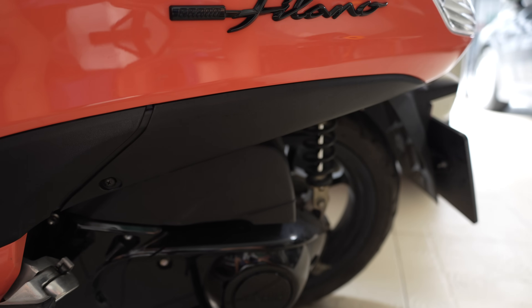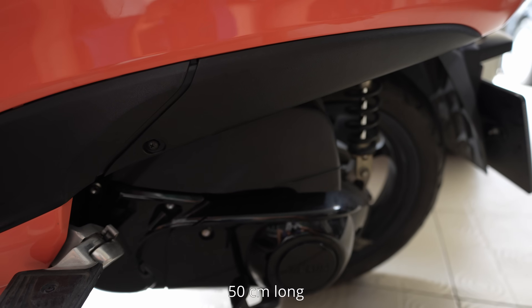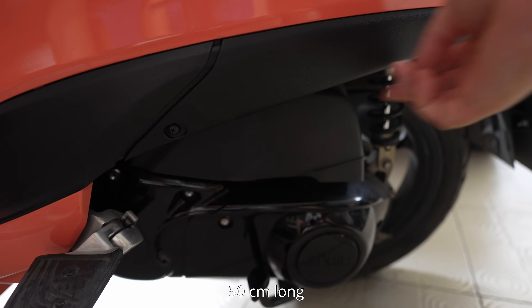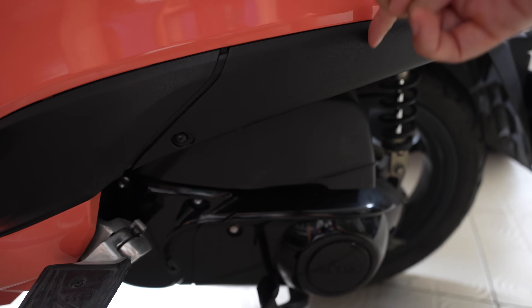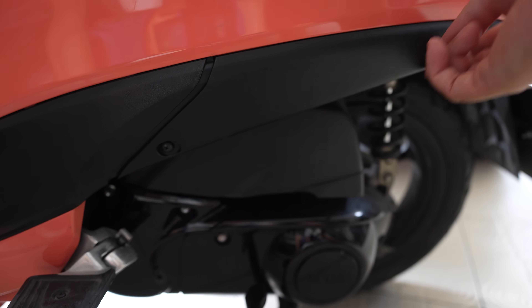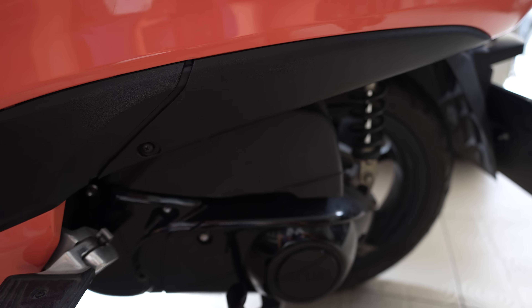In this video, I'm going to make a 3D scan of this plastic fairing. It's about 40cm long. So after I make a 3D scan, I will reverse it in CAD, split it into two parts so that my printer can print it, and then I will join it with a mechanical joint.